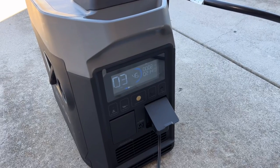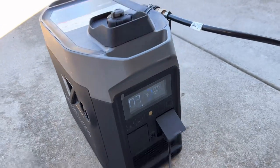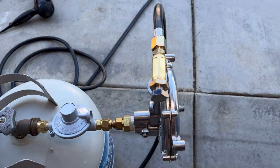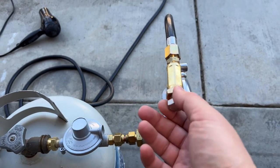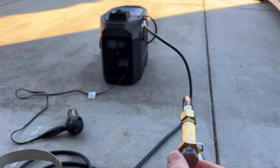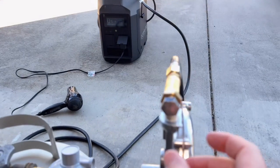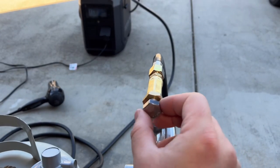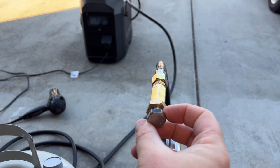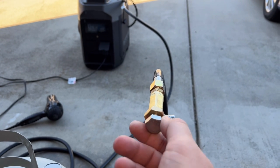Turn on the hair dryer at low — only a couple hundred watts — and let the generator stabilize. Hopefully it goes into eco mode pretty quick. Come back to the load block and make an adjustment. There shouldn't need to be much change since it's already set for low load. You can hear a slight change — I think that's it going into eco mode.